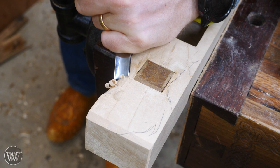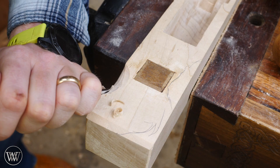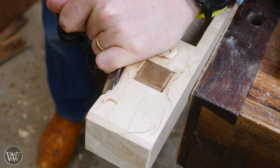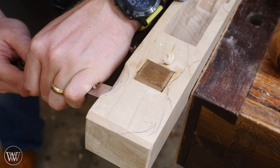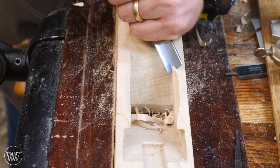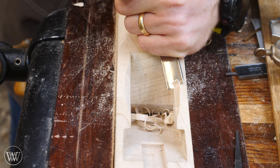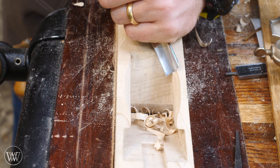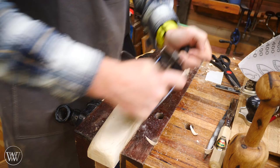On the front it's a little bit different because I am right-handed — I want it to actually have a weird grip so my thumb comes over the side and holds on. So I'm going to be doing basically the exact same thing, but spending a lot more time with the gouge, cleaning out and shaping and sculpting it, occasionally putting my hand there and checking it, then going back and sculpting some more until I get the shape right about where I want it. On this side will be a thumb hole and the other side will be where my palm sits, so it'll kind of be an S shape on the front. I'll be hitting it with all the files and card scrapers, and there's actually a little divot where the thumb is at, so I'm going to use this riffler to get into that concave area. The last bit of carving are the eyes on either side of the escapement — these are basically little spaces that allow your fingers to get down in there a little bit closer so you can clean out any chips that might get stuck. It's just as simple as grabbing a gouge and running it along that, trying to make both eyes look parallel and the same.